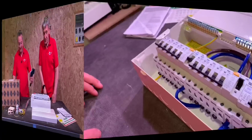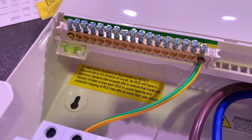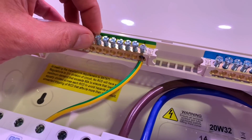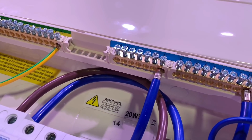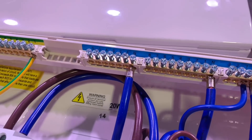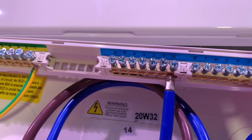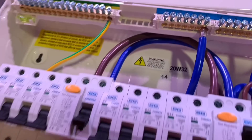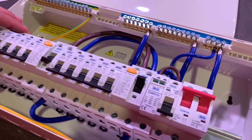The backed-out screws are large — no problem getting 16mm cable into any of them. They also have a little bit of Loctite so they won't fall out during transportation. The neutral bar has eight terminations on the right and six on the left, considerably more than the current configuration, giving you spares if you change things around.